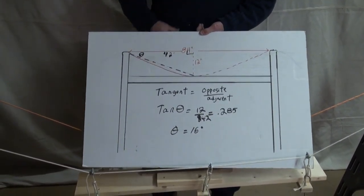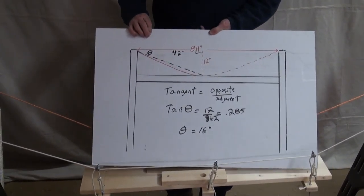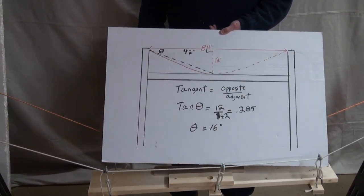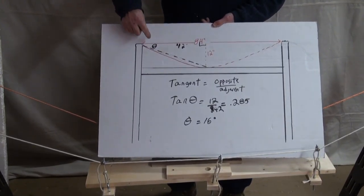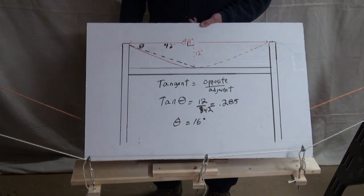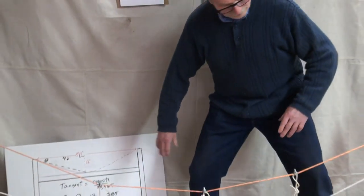7 feet or 84 inches is the distance between the towers. To compute everything, we're just going to work on one half, so that's 42 inches. The sag was 12 inches. We want to figure out the angle theta. We use tangent. If you've forgotten your trig, trig isn't that hard — there's only three sides of the triangle, three angles, there's only so many ways you can juggle them. Tangent is opposite over adjacent. The side opposite the angle is 12 inches, and the adjacent side is 42 inches. We get 0.285, then we go to the tangent table. We see what's closest to 0.285, and we get 16 degrees. So this angle is 16 degrees.